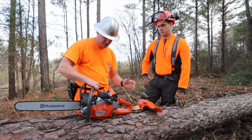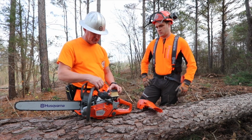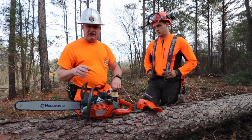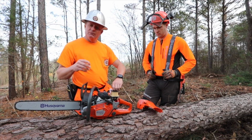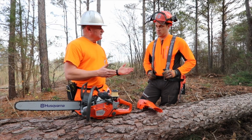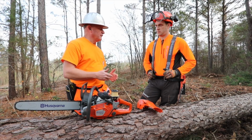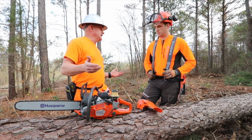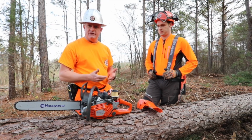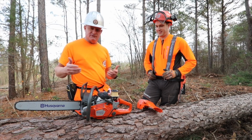But Kiel and I were talking on the phone yesterday as he was coming down. A 70cc saw is not a small saw by no means, but it's not as large as a 395. You can take a 70cc saw, and if you've got it tuned right with the right chain, you've got it sharp, you can cut anything you want to. You don't have to have a 100cc saw or anything like that. That's what I do on my saws, is tune them.